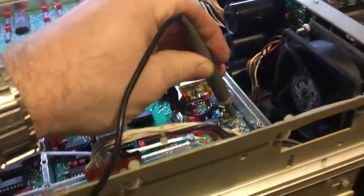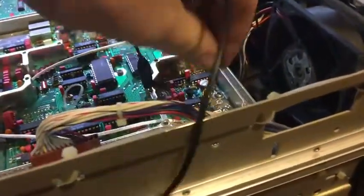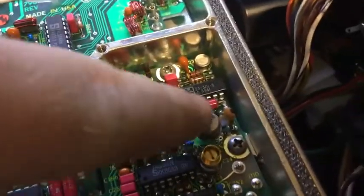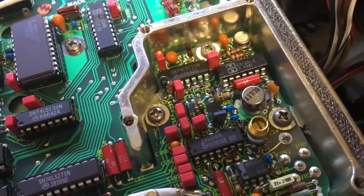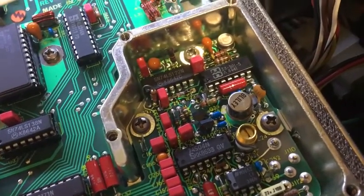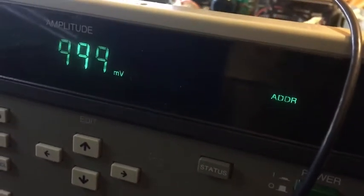So I've actually fixed that. Just need to do that final little bit of calibration work on it. I've tidied up the ceramic there. I shouldn't really use the ceramic there. I should use something else. 10 pF, a bit frequency temperature sensitive, so it may or may not be a problem for the oscillator that's in there. And the unlock is actually going away. Hold on, if I turn the IFR output back on again, there you go, unlock has now gone away.